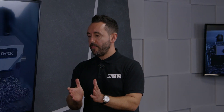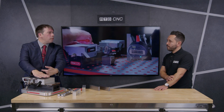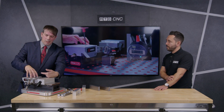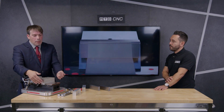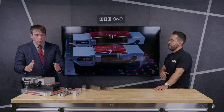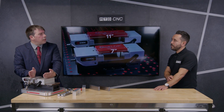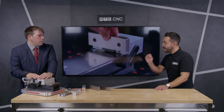The OneLock has a built-in mechanism to prevent jaw lift and jaw deflection. You can't really see it on the outside, but underneath the fixed jaw there's a wedge system that directs clamping forces through the jaw. So when you have a force from the moving jaw, you have an opposing force in the opposite direction inside the jaw carrier — this prevents the jaw from tilting under load. On the moving jaw, you have a rack that drives the jaw backwards and forwards, and the engagement angle prevents the jaw from lifting when it's under load. So you have two very parallel jaws coming together with no lift and no deflection, giving very high quality surface contact — and with that, it eliminates vibration.